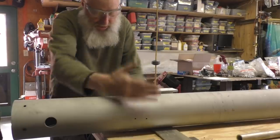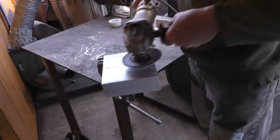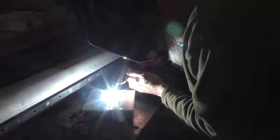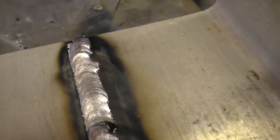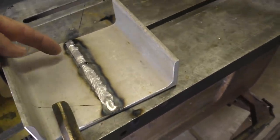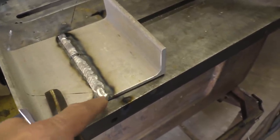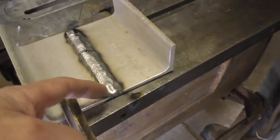Neil's done a fair amount of aluminum welding too, and like we always say, it's not that hard - you just got to practice. Nice and clean, yeah, nice and quick. I tacked in at the end - that's really important. What we're talking about is putting a tack at the end because when you bring the weld up to it, the table soaks up some of the heat. But it diminishes how much heat it can soak up at the end of the metal, so the tack lets it come in hot. If you try to bring that weld all the way to the edge, you always blow through.